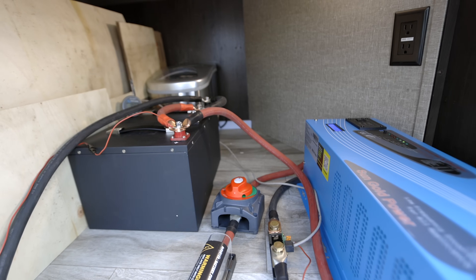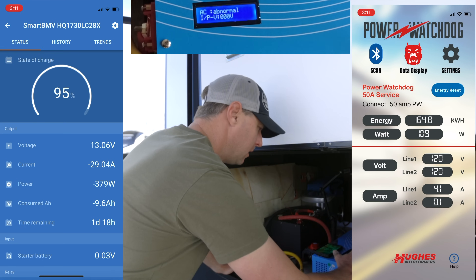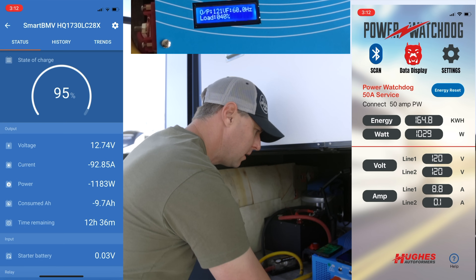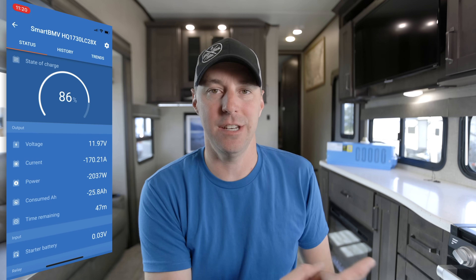For our setup we used two SOK batteries — 200 amp hours — with the 3000 watt inverter. First I wanted to do a capacity test to see if these batteries could hold up to their claim of 100 amp hours each, usually done on a 20-hour rate. We did it using the RV normally and some larger items got used during the test. At 204 amp hours the batteries were still going, with loads up to 170–175 amps at times running the toaster oven and everything in the RV over 2000 watts — very impressive performance.